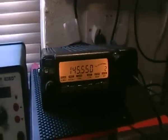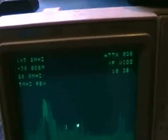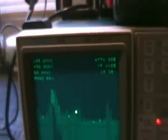I'll give you an example. I'm just going to switch this lead on with this bulb on. This is just one of the frequencies we use, and I noticed I was getting a full carrier — I actually thought the radio was transmitting. So I thought we'll have to investigate it. I've got the spectrum analyser in line. That blip there is your general radio stations, and it's set for just around 145 megahertz.